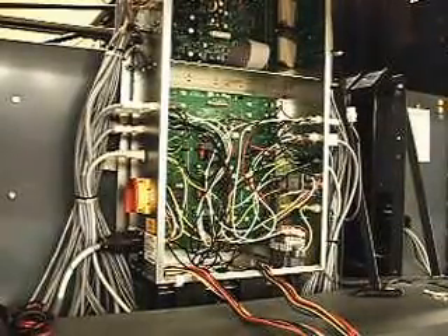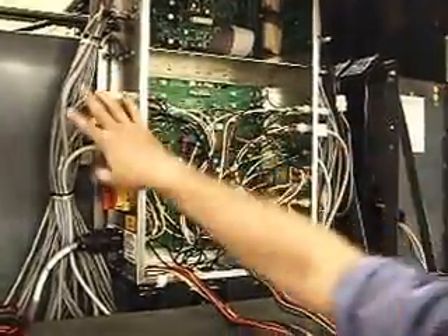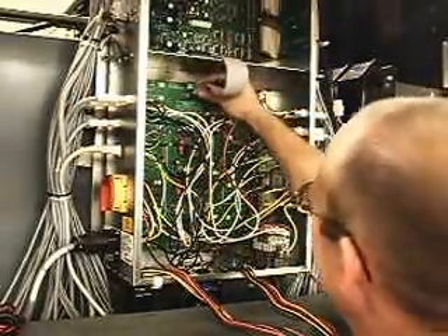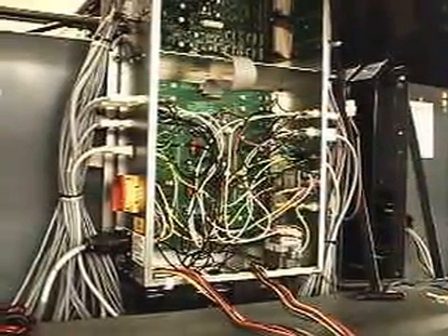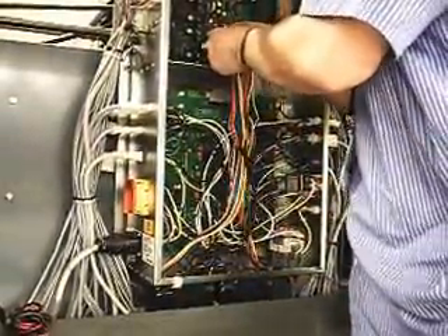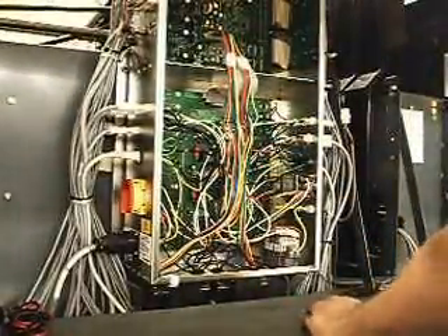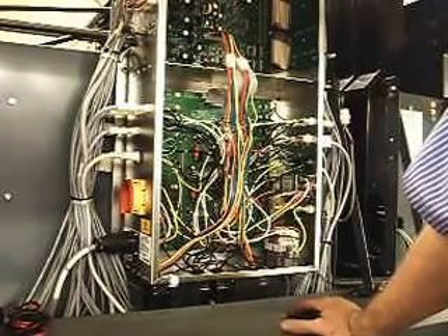There are 43 jumpers to check — except number 41 is open, there should be nothing on jumper 41. I've got all of them hooked up, all my side cables hooked up. I've got to reconnect my ribbon — push it in there nice and easy, don't bend any terminals over. Connect my 20-pin connector. I did a slow methodical check after I plugged everything in, going one clear through 43 all the way to the bottom one at a time, making sure everything's connected right and seated properly.